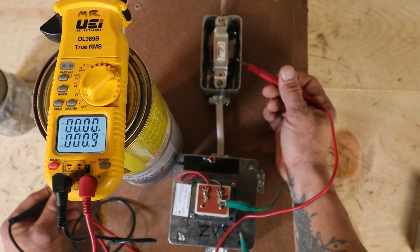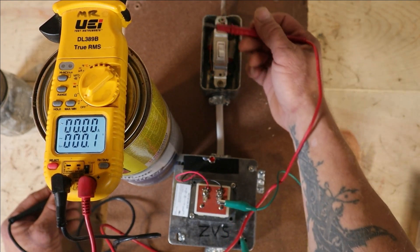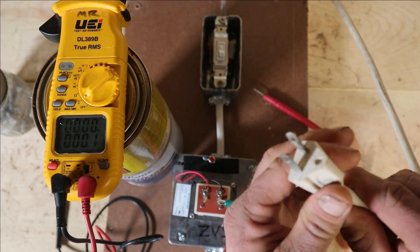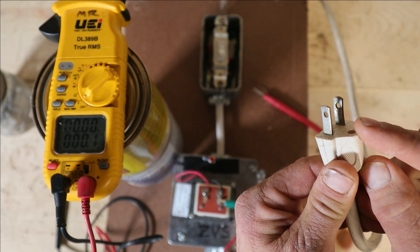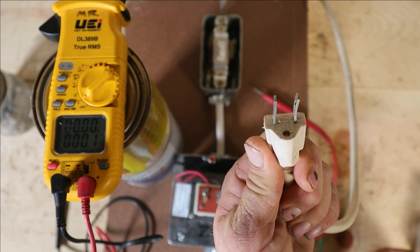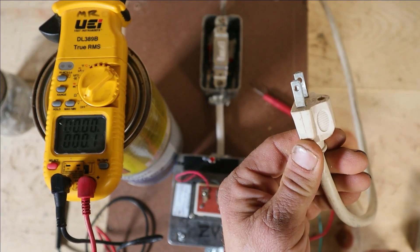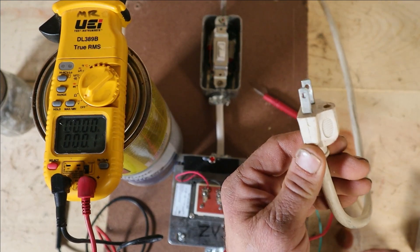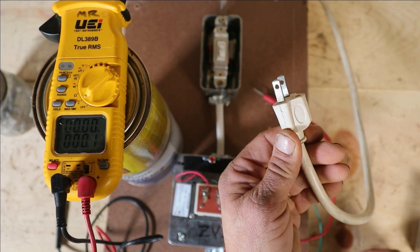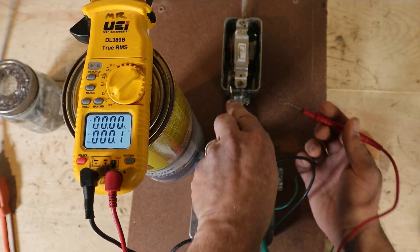That can mean a loose wire connection on my ground wires. What I found when I traced the whole circuit back was this: somebody had broken the ground prong off of this cord so that they could plug it into a two-prong outlet, and that caused my circuit not to be properly grounded — it was the reason why I got an odd voltage reading. So your multimeter is always trying to tell you something, even if the readings are bad.